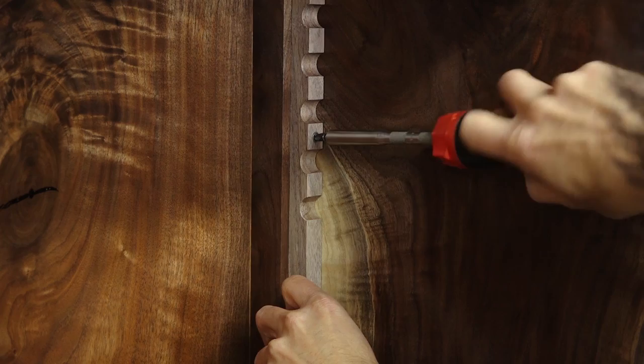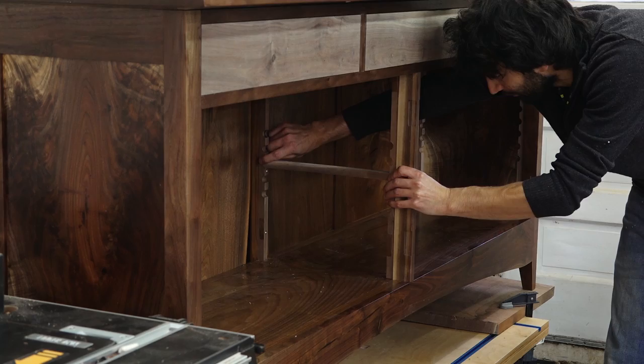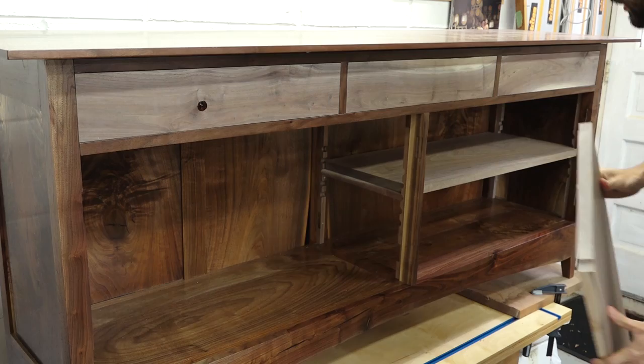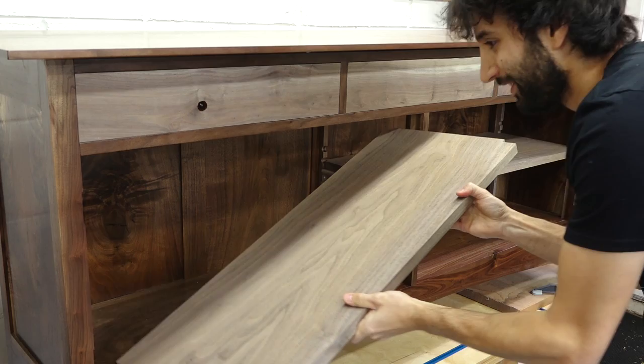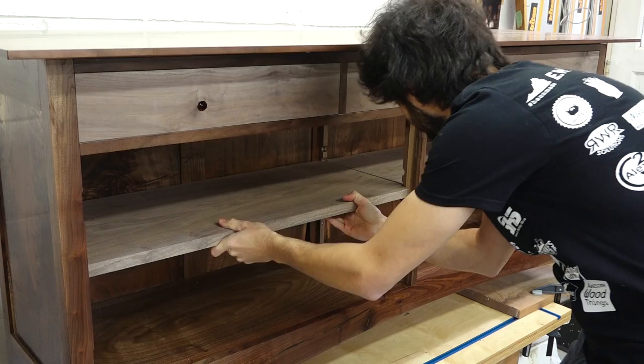These standards are super easy to make, which is nice as well. The only other kind of weird thing about using these standards as opposed to shelf pins is that the shelves just need to be kind of notched around the standards, and in my case around the legs, so that they meet and they're all nice. One other small detail is that for the shelves, I decided to use one longboard, so I have continuous grain across the whole shelf, which is a fun small detail as well.